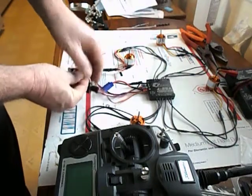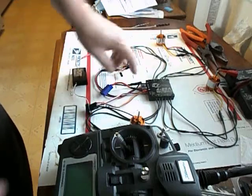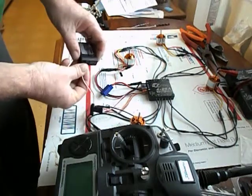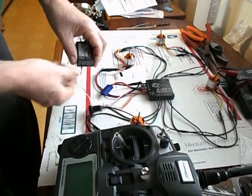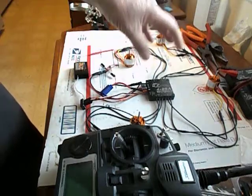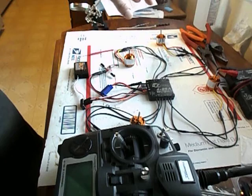The Q-Brain comes with what they call a throttle hub. You plug your ESC servo-type wires into this hub and then plug the hub into channel 3 of your receiver — that's your throttle. What I'm going to try to do is program the throttle range into this ESC before I install anything else to it.